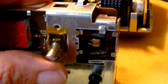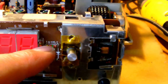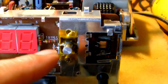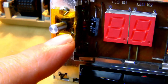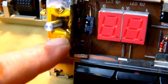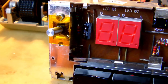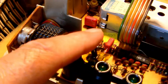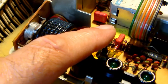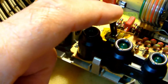The function really of those felt covers was to close up that gap around the stem, so that no FODs, foreign object debris, could enter the switches. Same thing over there, you see. So these little covers prevent foreign objects and dirt from entering those switches. So that's perfect. And I did the same thing with that mysterious little switch here on the band, well, the channel selector. I still need to find out exactly what this switch does.